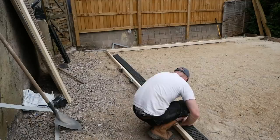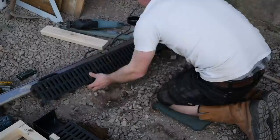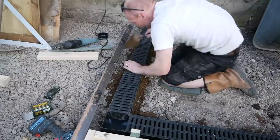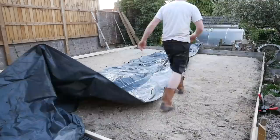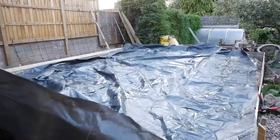One of the last things to happen before the concrete arrived was to get the drainage sorted. This carries basically surface water from the path, but also from the garage flat roof. So it was important to get the fall on this right, and I wanted to make sure that was all in place and bedded down before the concrete arrived and it wasn't going to float up or get nudged. So with that in place, I could move on to getting the membrane down and getting the final bits of prep done the day before the lorry was going to turn up.